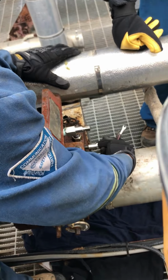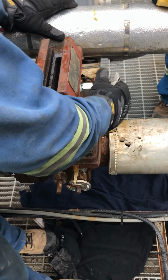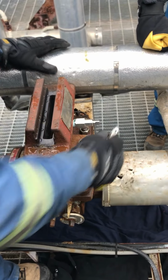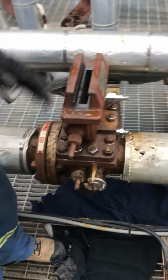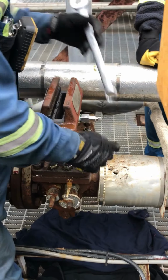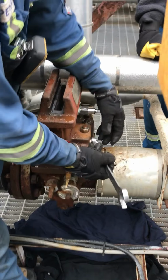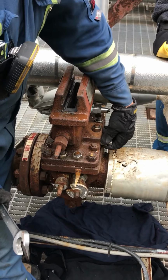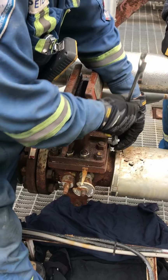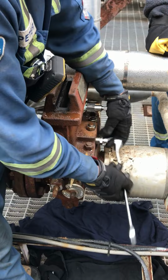Set that on the table. Okay, so there's your wrench back. Now, the second thing you take off is the equalizer. Usually with equalizers, you see how that whole thing turns? Jeez, unbelievable. That's their tightness. Anyhow, pretend it's an old one. Pretend it's tight. We're going to take the packing nut off.